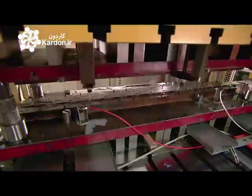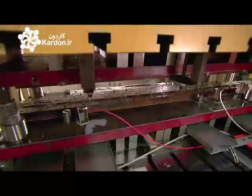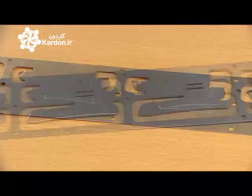The strip of stainless steel winds off a reel and moves through a 300-ton punch press. It works like a giant biscuit cutter, striking a series of dies against the passing metal. This is one part of the multi-tool's 2-part handle.